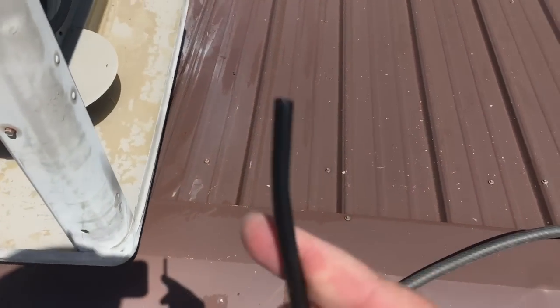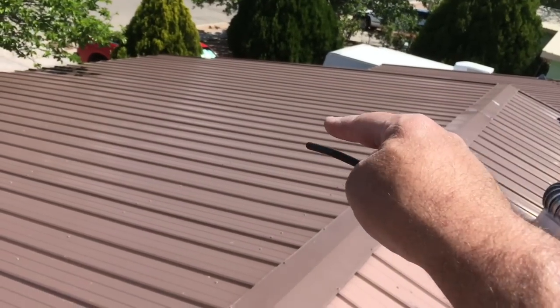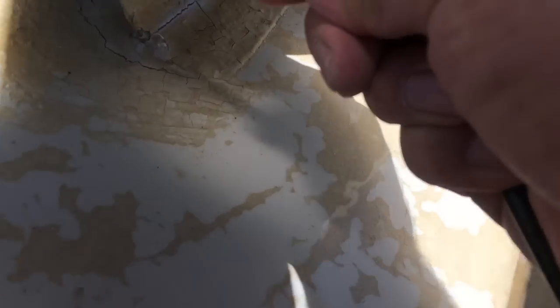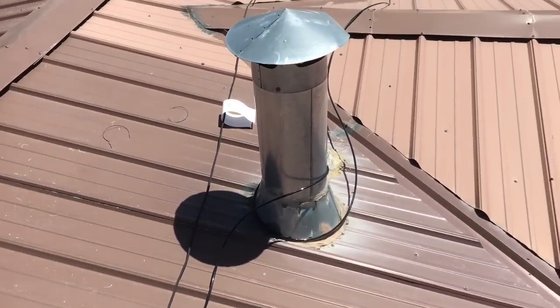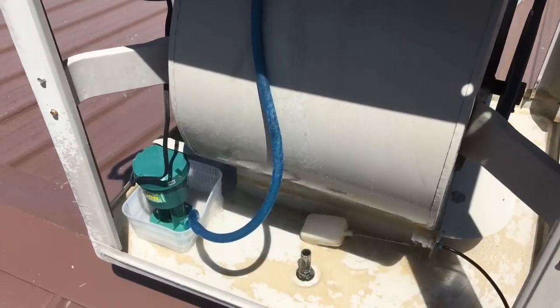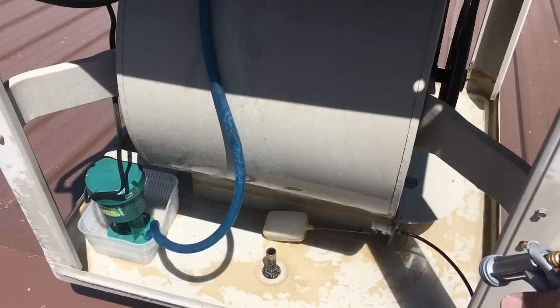Now I'm going to connect the tubing - it's going to run across and down in front of the garage where I've got a faucet to hook up the water supply. Important thing is you put it in through here, stick it on there real good. I've run the line across the roof and down over to the faucet at the water supply. Now I'm going to fill the basin to get the float up in the approximate area, because it takes a long time to fill up through the float.